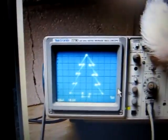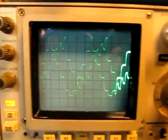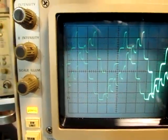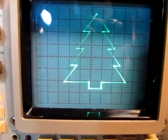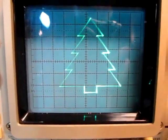I thought that was a really neat use of being able to draw something. I've got this sketch loaded up on the Arduino and these are the waveforms that the sketch creates on the two channels. If we put the scope in XY mode you can see it draws a Christmas tree — he's got 19 vertices, or XY points, and just draws lines between them.